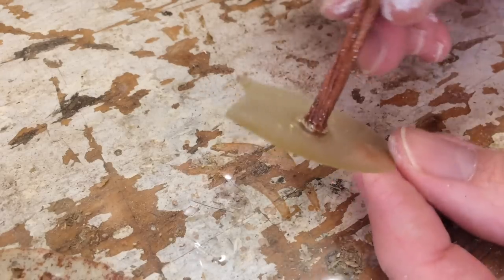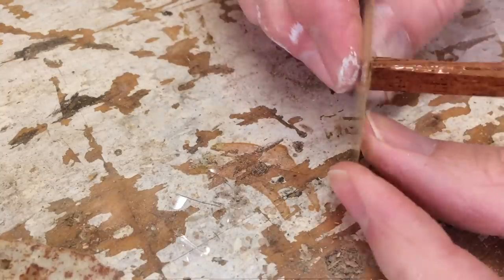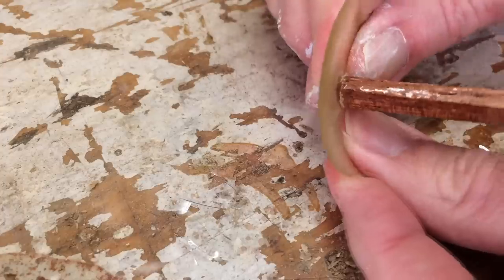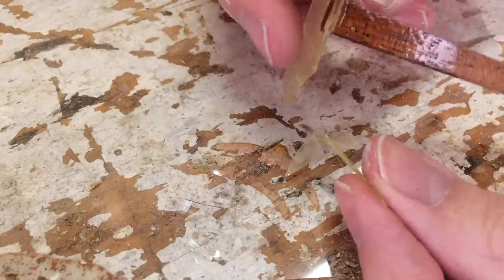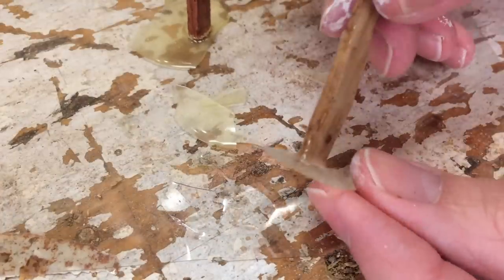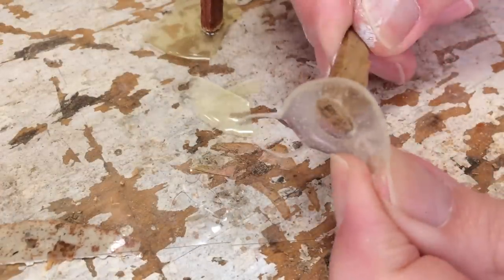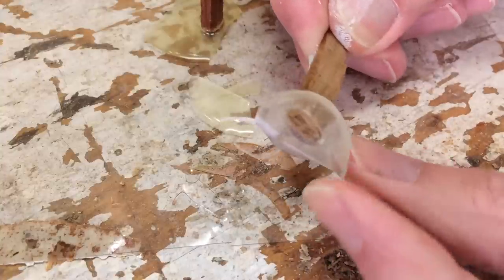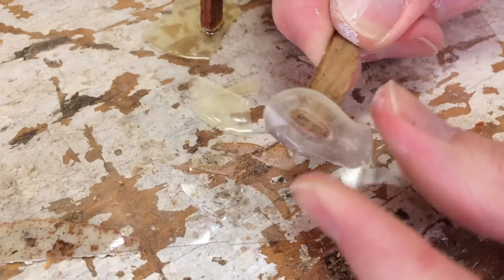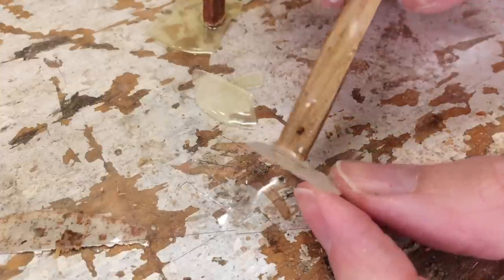This is the epoxy that I use. This is the hard epoxy. And if I break this off, I actually can't. Let me see. You hear how hard that is? There we go. That's how hard this dries. And then the 5-minute epoxy, this is a sample here. You can see I can bend this. It's flexible. And that's why I wanted to use this on the joints of that furniture, because it will move slightly with the seasonal wood movement and hold that chair together.